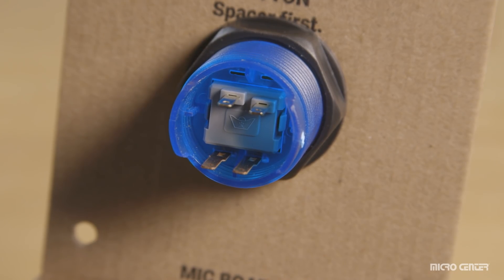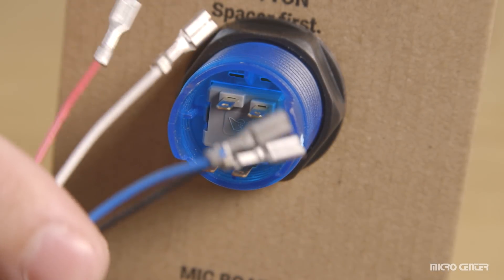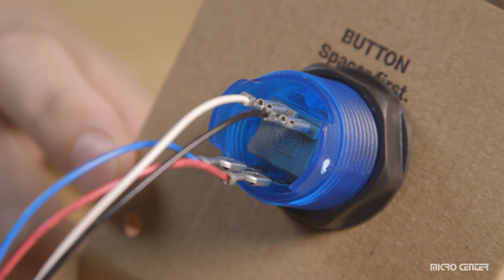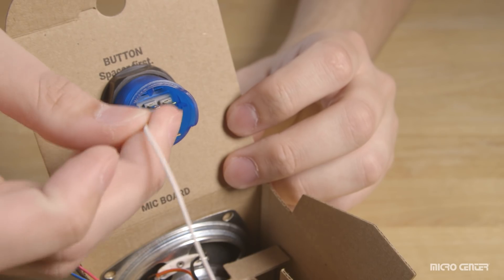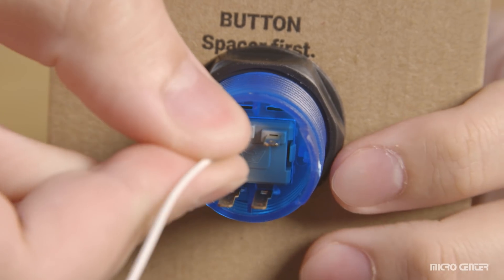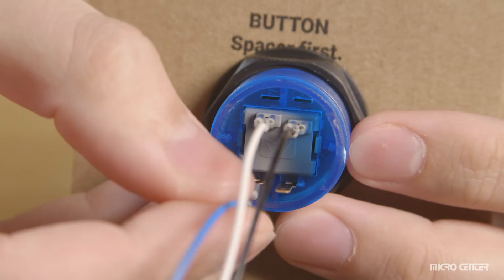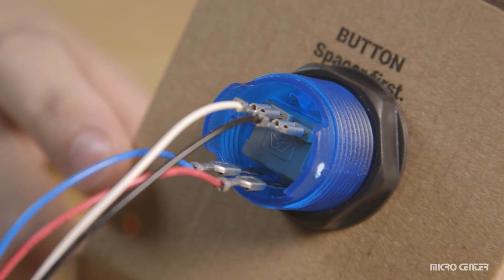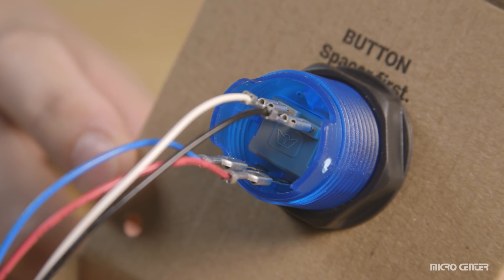Now return to the colored wires with the metal connectors. Look inside the button — you'll see a logo etched into the gray plastic that indicates which colored wire connects to which pin. The white and black wires plug into the gray plastic and control the button mechanism itself. The blue and red wires plug into the colored plastic and control the LED light inside the button. Make sure the orientation matches the finished picture.